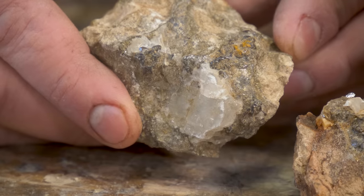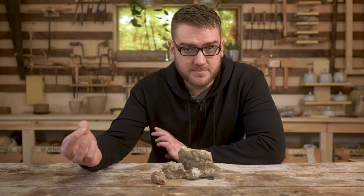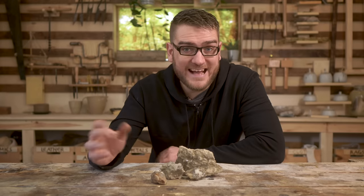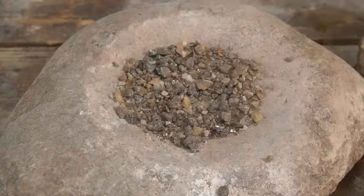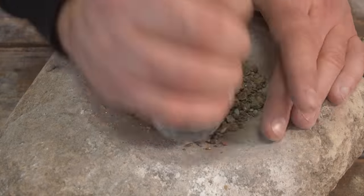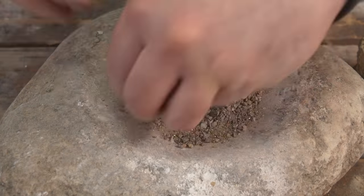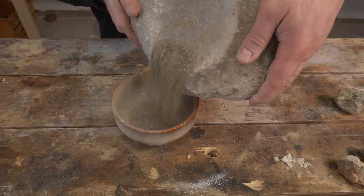In that process, there's not going to be much liquid, because the zinc ore is going to vaporize into gaseous zinc, which is then going to be absorbed into copper, and the copper will actually be below its melting point. So theoretically, throughout that process, we're only dealing with solids and gases. But once they mix together, we'll be doing that just at the melting point of brass. Theoretically, the result should be a puddle of brass and probably a fair amount of slag from the impurities in the ore. From there, we can just melt down the brass itself independently and cast whatever we want.